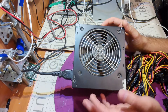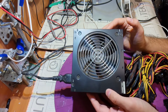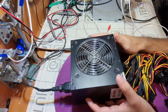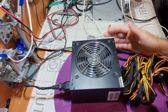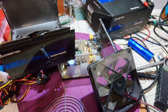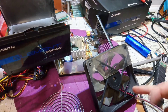I'm going to open it up and look at the capacitors. Usually caps get low and cannot sustain the load; sometimes other problems can be seen. I should open it and see what's inside. If I find something interesting I will show you — maybe somebody would find it useful.